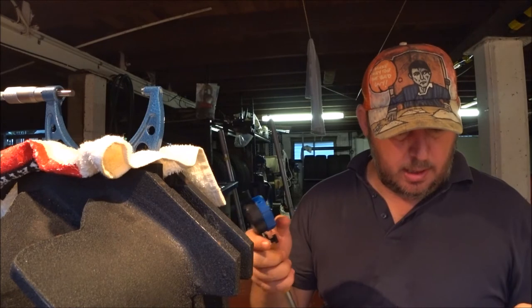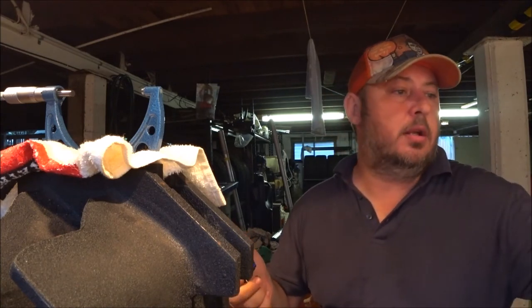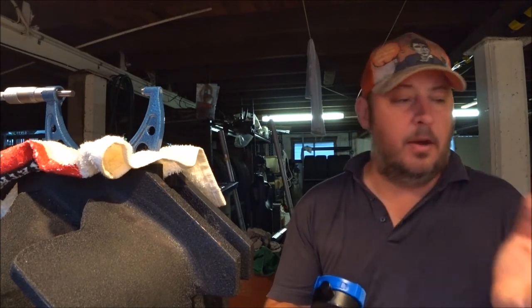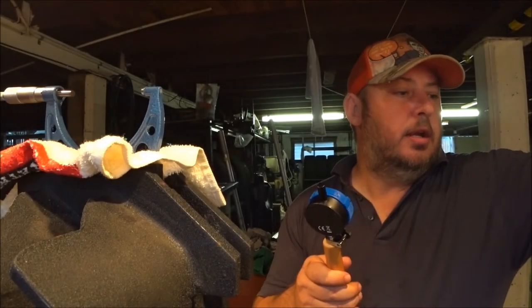Turn the piece out of the bore gauge, press CAL button — CCC appears. Long press CAL button, which is calibrate. CCC appears then disappears — calibration is finished. Yeah, CCC came up on the screen and then a second later it went away. Short press start. Min blinks and bore gauge enters measuring mode. Insert the bore gauge into the workpiece and sway the bore gauge wiggly — it's actually what it says here. I'm not making that up.